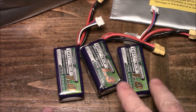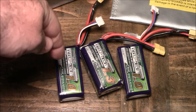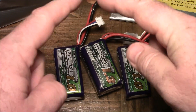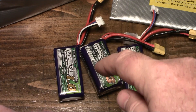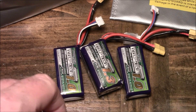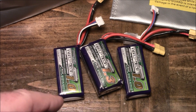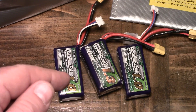What the balance port does is it has a direct connection to each of the three cells. When you force juice into all three, the balance port sees which cells are already full and starts drawing juice off them so they don't overcharge, while leaving the low cell alone so it can accept more charge. Overcharging is probably the most common problem people have. Even when you watch videos of LiPo batteries exploding, they're essentially overcharging the batteries until they can't take it anymore.